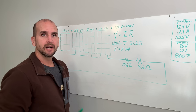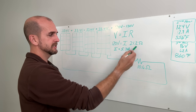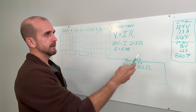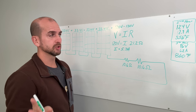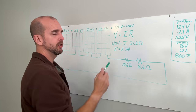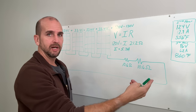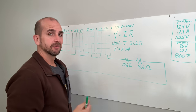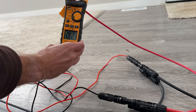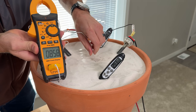Using a simple equation V = IR which is Ohm's law we could get theoretically our current. If we know our voltage is 120 volts and we know our resistance of these two resistors is 21.2 ohms, we would expect a theoretical amperage of 5.7. Now when I measured my second hour I got 124 volts — the sun was just cranking — and 7.9 amps, so it was actually quite a bit higher. I might want to re-measure my ohms across those resistors; maybe it's actually a little bit lower than I expected, and that would explain in actual practice why I'm getting more current. And then we had 556 degrees Fahrenheit for the center temperature in the second hour, and then in the third hour — there was a little shade on the panel so voltage dropped to 96 and we're getting 6.2 amps — but the center temperature is now all the way up to 860 degrees Fahrenheit, which is actually way higher than I thought it would be.